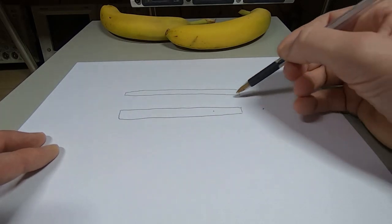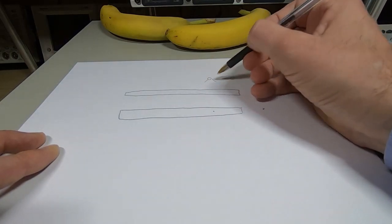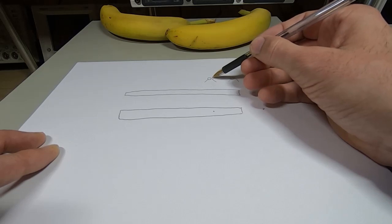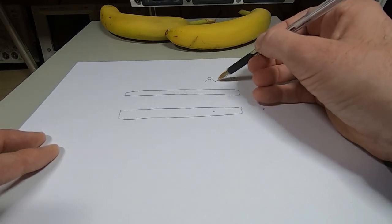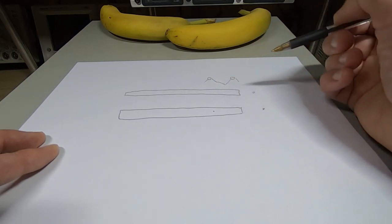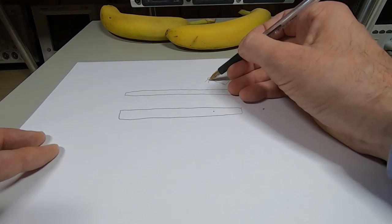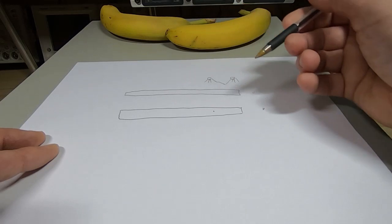And because if we look side on, you've got the heaters shining down, you get kind of a radiant pattern that looks like this. They actually overlap in certain places. Now if the heaters were the right spacing, the right height, the overlap might be enough so that where the heat does overlap, you obviously get an increase in energy, but that's not the way this chamber's arranged. That wasn't really working. What we needed to do was create a shadow underneath each of the heaters to cut down the energy that's going directly down onto the board.